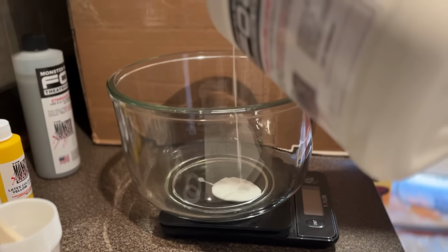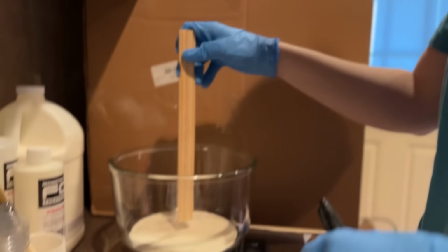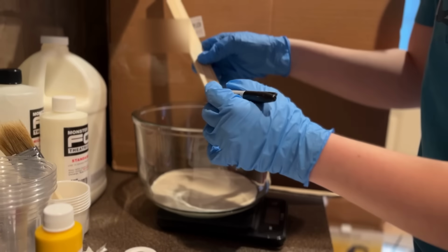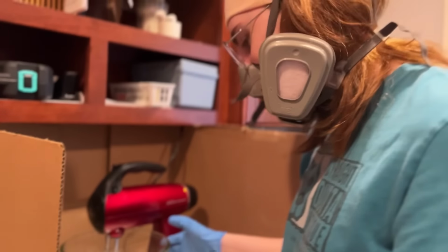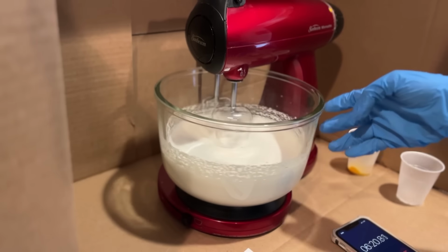However, foam latex can be very tricky to use since it needs to be carefully mixed in certain intervals using a specific type of mixing bowl at a certain temperature and humidity with very precise amounts of ingredients. It also needs to be baked inside of stone molds that can wick away moisture and not melt in the oven. It also emits a ton of fumes and it's super easy to mess up.